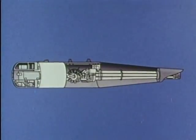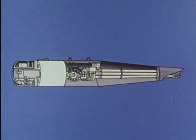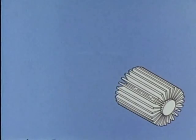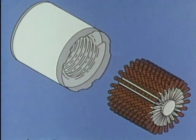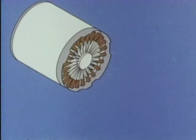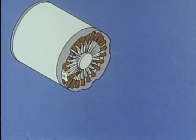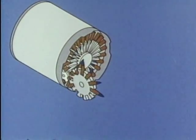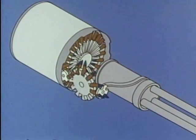The GPU-2A utilizes a linkless ammunition feed system, which significantly increases gun system reliability over linked systems. The ammunition drum assembly consists of a rotating inner drum with radial partitions located along its longitudinal axis. M-50 series 20mm ammunition is held between these partitions. The fixed outer drum contains an integral stationary helix. Rotation of the inner drum feeds rounds forward through the outer helix. An exit unit with a sprocket assembly transfers the rounds to the conveyor wheel, which moves the rounds to a single sprocket assembly in the pick-off unit. The pick-off unit, in turn, transfers the rounds to the gun feeder assembly.